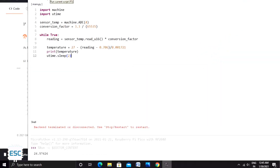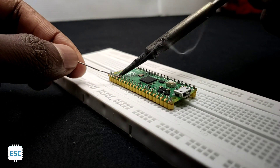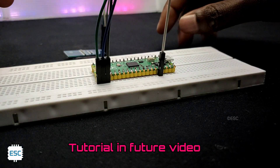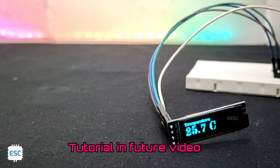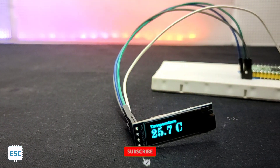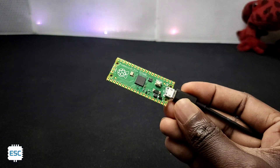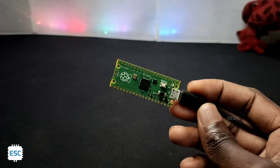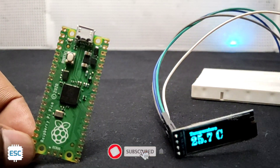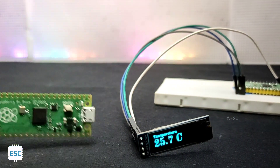Now we can go further. Here I'm reading the internal temperature of the RP2040, and you can see everything is working very well. I'm also showing how to display these values on an OLED screen. In a nutshell, this tiny $4 microcontroller comes with rich specs like dual I2C support and programmable IO pins. In my opinion, Pico is just awesome for beginners and pros. In future videos, I'll make projects with Pico. Hope you learned and enjoyed — please like, share, and subscribe. Thanks for watching!